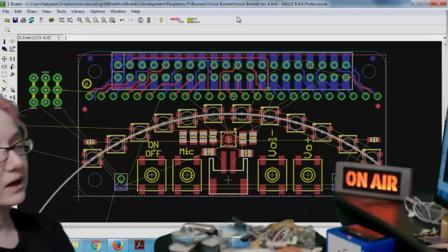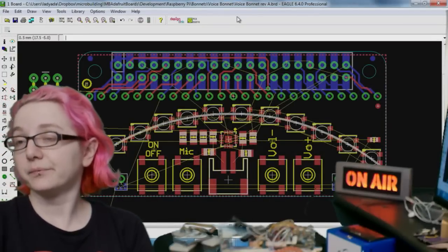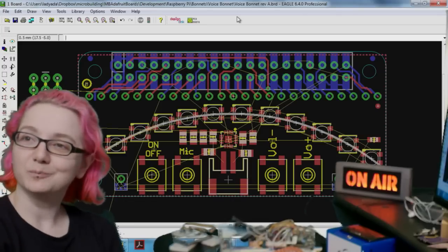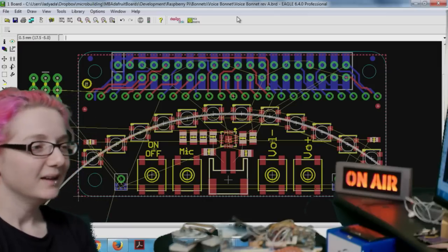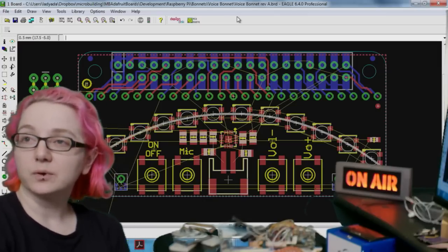So just an LED, like a light sensor. Yeah. So it's going to add $1 worth of cost. Can we put pads on there so someone can add it later? No. Nope. Okay. All right. Next. Because it doesn't have analog in, so you have to go straight for an I2C light sensor.